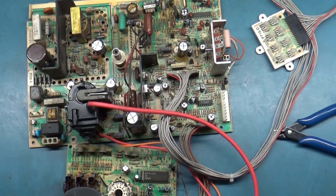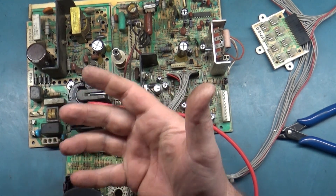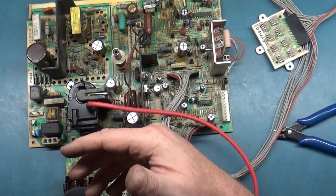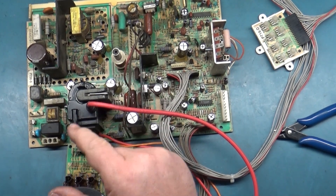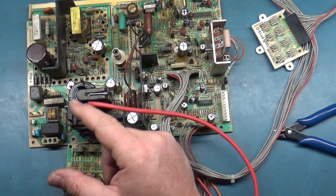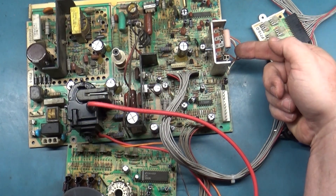During the interim since I last left you, we had collapse. I suspected the flyback was bad — and it was bad. It was on its way out, making all kinds of lightning noises and high-pitch squeals, internally not happy. So I changed it out and tested it again — and it was still collapsed. So the flyback was on its way out, but it wasn't the cause of the problem. We kind of already knew that because we had our 30 volts.